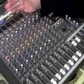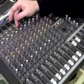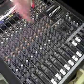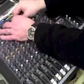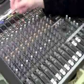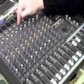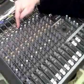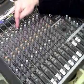What you would normally get in there is a 1/4" jack wired in TRS configuration, so that's tip, ring and sleeve. With the tip, I think, sends the signal, the ring returns the signal, and the sleeve is the common ground. So you have a 1/4" jack going in there with a Y connector into your send and return, 2 jacks then into your processor, and the one jack both sends the signal and receives it back into the desk, and they're quite common. They're easy to get hold of, those Y insert adapters. So that's what you use that bit for there, for a signal processor.